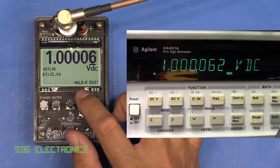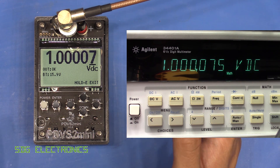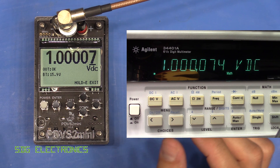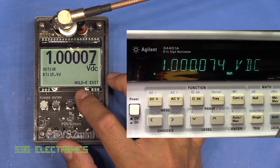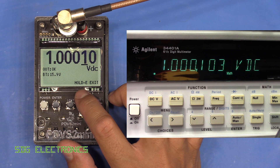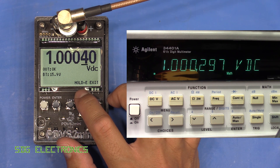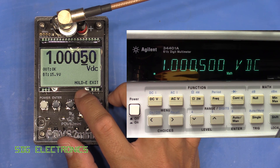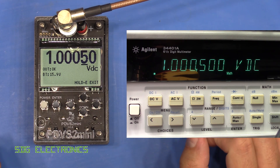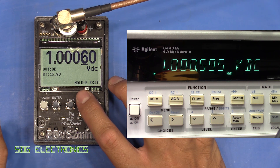The readings are pretty much spot on. Obviously there is a limit to the resolution - this has a 20-bit DAC so there is some error present on the least significant bit. But once you start increasing the next digit in, we're getting very much closer to what it's reading. It's really quite impressive. If you paid for one of the big calibrator devices you'd be spending a lot of money and basically getting the same amount of resolution.